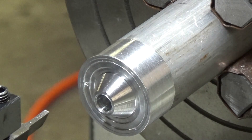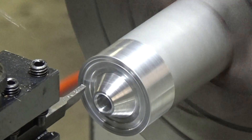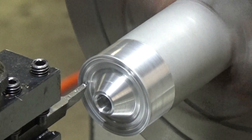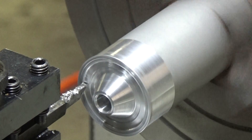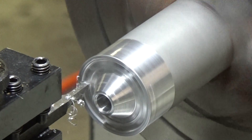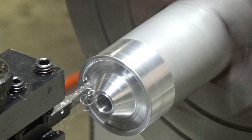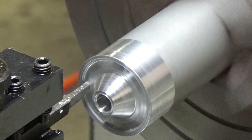For the trepanning part, I've changed to a high-speed steel bit and I'm going to give that a try. Since we've got the DROs here, I'm going to try to get in there about a half inch.